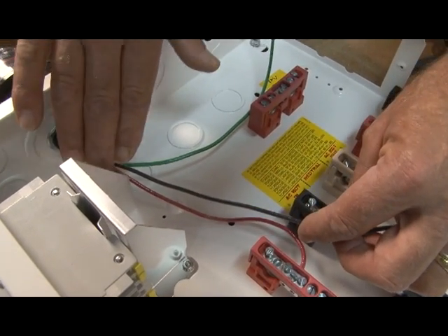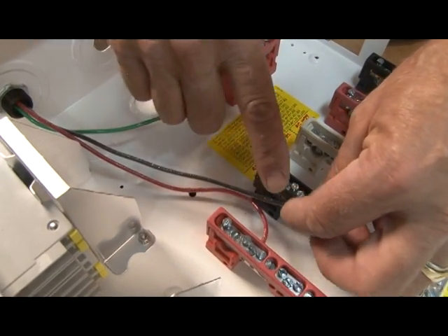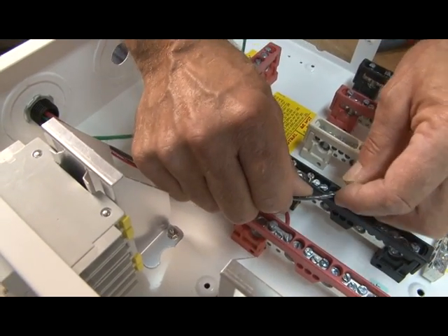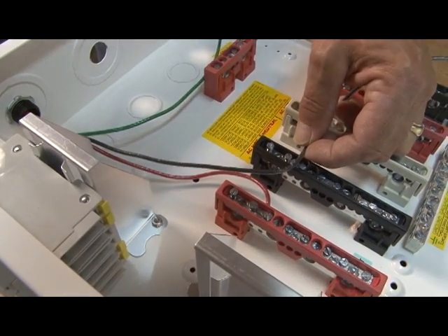As it's coming down, we'll be tying this off later. Make a nice, easy bend — I just use my thumb. Just a nice, easy bend, and give it some extra slack. Lightning does not like going around tight corners at all.